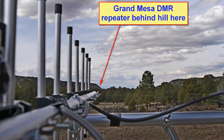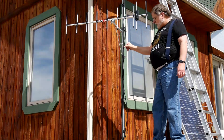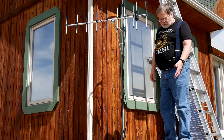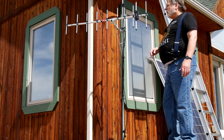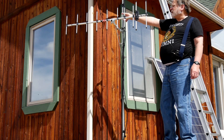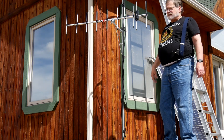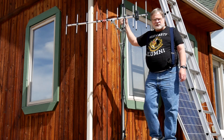It is pointed as straight at that repeater as I can make it. I'm going to get some coax, connect from here, wire the coax along the shaft, come out the extension and down to the shack. The thing is many wavelengths above the ground, so adding height would only give me a little more distance — but five watts will do that just fine.